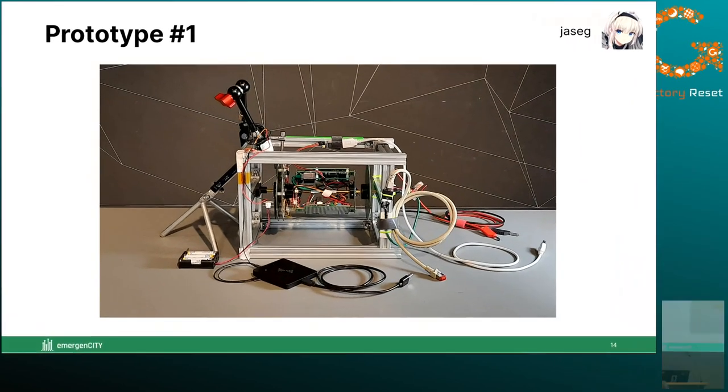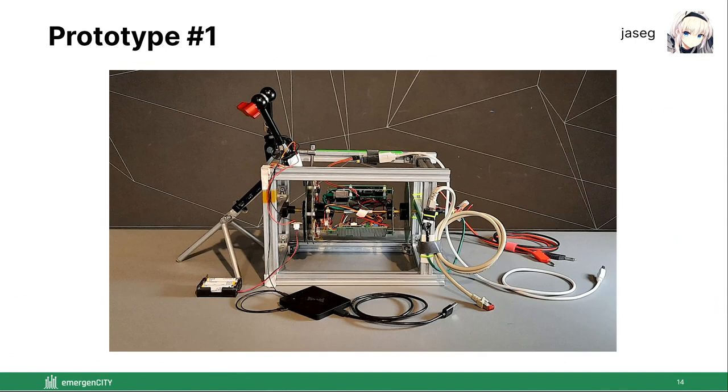The axis in the middle is just a brass rod from a hardware store. That axis is where power and data go through from the outside — there's a thin Cat-6 cable running through one end for data, and a thick wire for 12 volts for power supply. That's basically a loosely speaking functional system — it shakes a lot due to construction not being properly weighted, but this is what a DIY HSM looks like. All the parts you need: a tamper protection barrier in the form of security mesh from PCB materials — either etched yourself if your hackerspace has a chemical setup, or ordered online. It has space for one or two Raspberry Pis in the middle.